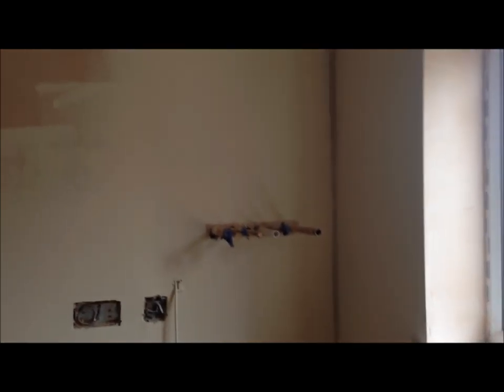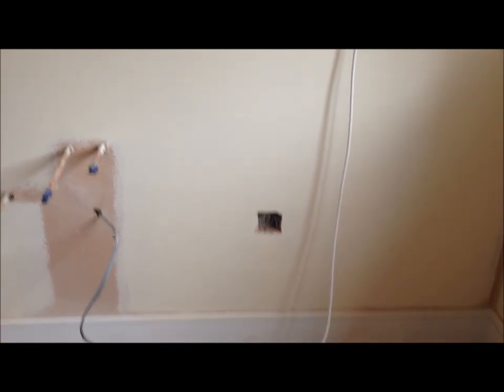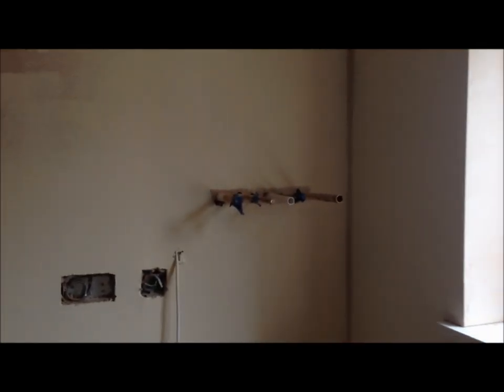Another area is in the kitchen round where the boiler goes. Get a double coat round that boiler area on the wall where the boiler is going to go, and also around the plugs. Don't forget those sections round the plug, because nine times out of ten that's going to be an open space and it will take you a lot longer to cut that in. If you can double roll it before it gets fitted, that's a bonus.